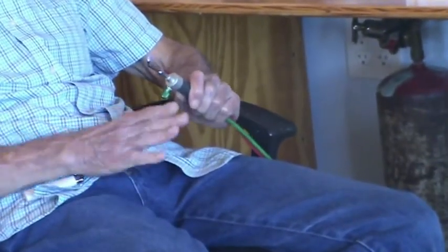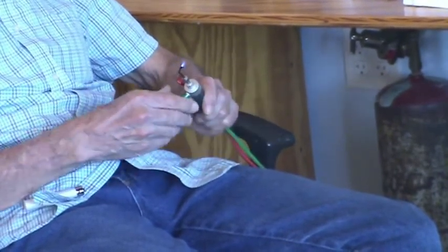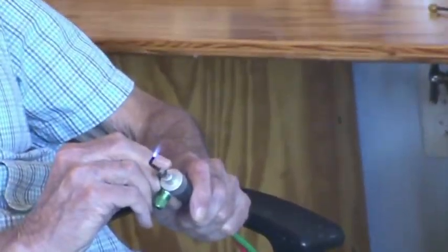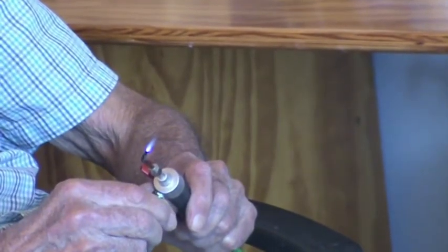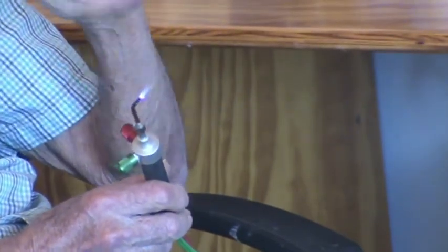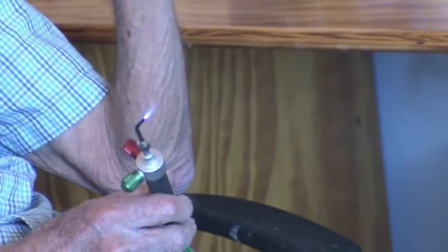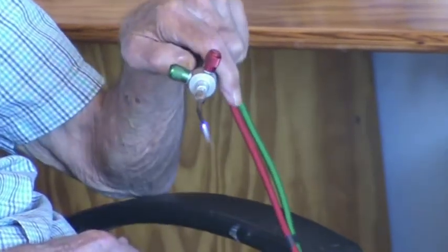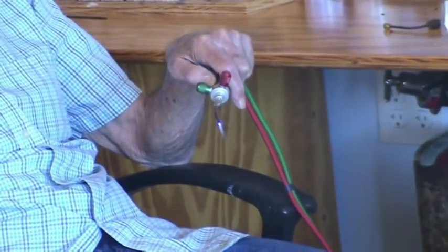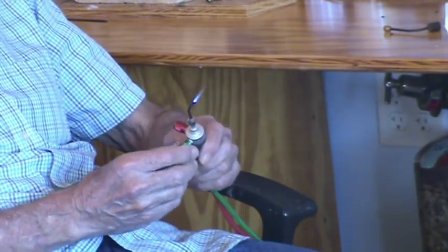But look how tiny that flame is. I mean, it's tiny, and they even go down, I believe, one more size, maybe two. But with that much heat, it's amazing how quick it will put precise heat on a little small area. And then, like I'm saying, when you're re-tipping prongs for diamond rings and stuff, you just take that thing down there and get it close to the prong, and almost immediately that prong will come up to near melting temperature. Again, that's why this is such a versatile little torch, and I like it so much.